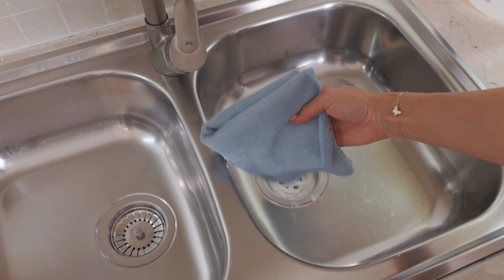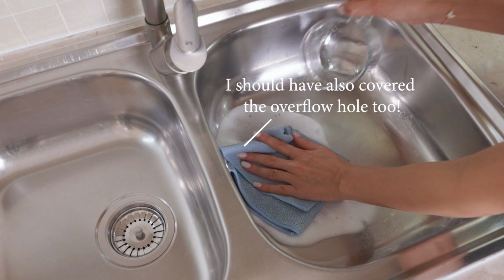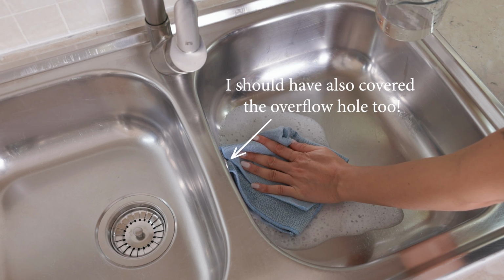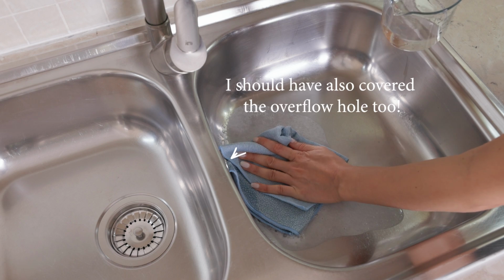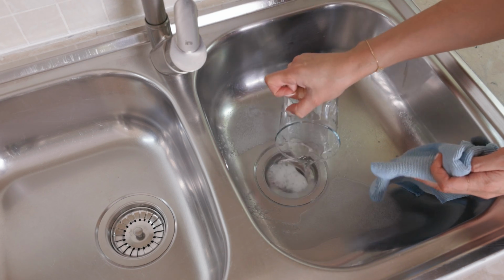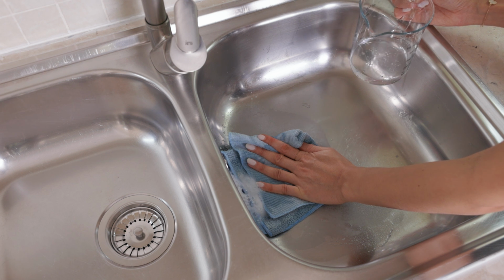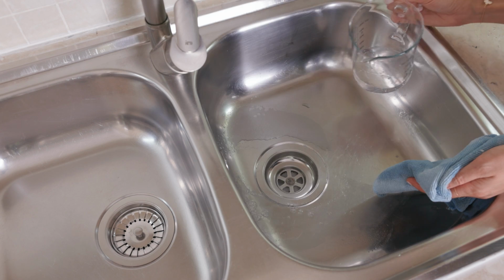Yes, mixing vinegar and baking soda together is actually pointless for cleaning because it just makes salty water. However, here we are not doing this for cleaning properties. The chemical reaction of the vinegar and the baking soda creates a foaming reaction due to the release of carbon dioxide that lifts up the grime and helps dislodge the debris, which in turn helps unclog your sink. It also has odor neutralizing properties.